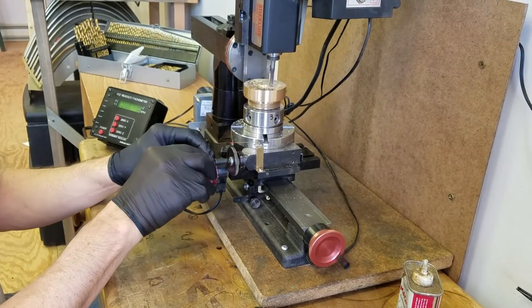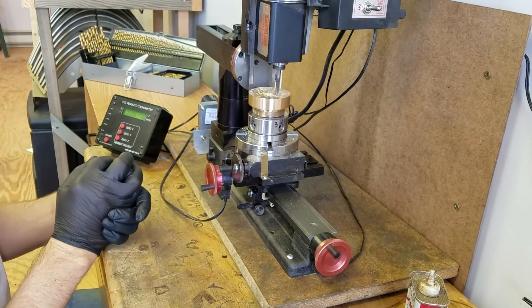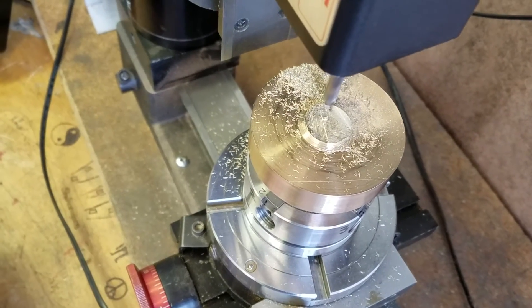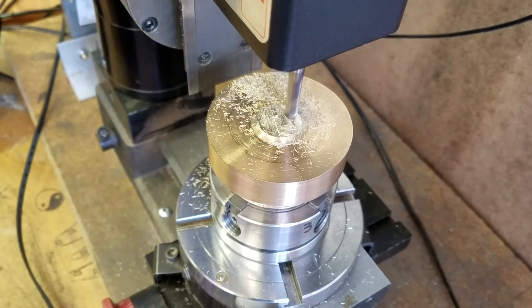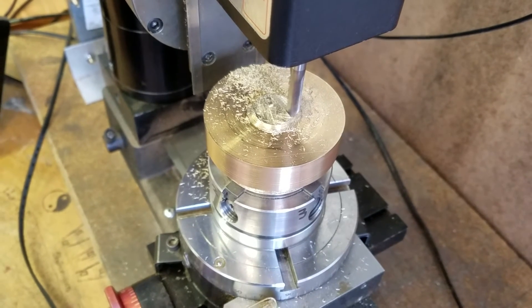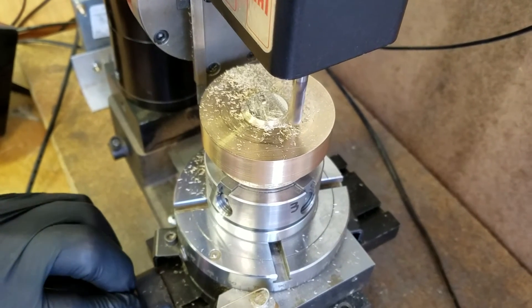As you can see, we're now not holding it from the end where the top of the radiator cap is — we're holding it from the bottom on the inside. That particular piece was at least sawed off partway, and now we're removing the last of it, about thirty thousandths per pass, using that power feed system, and we're just milling it off so it's level with the top of the radiator cap.